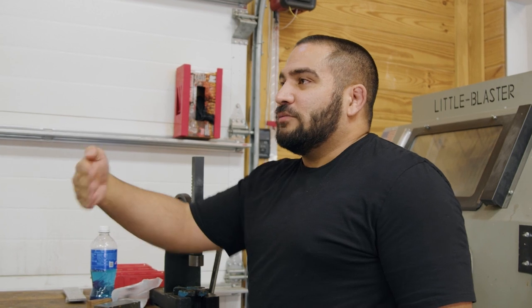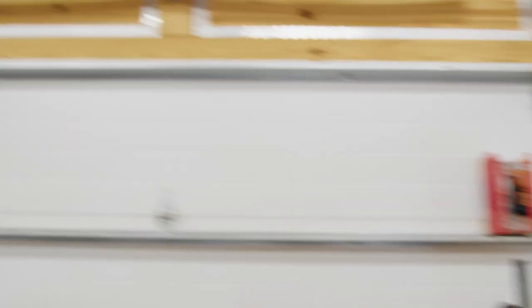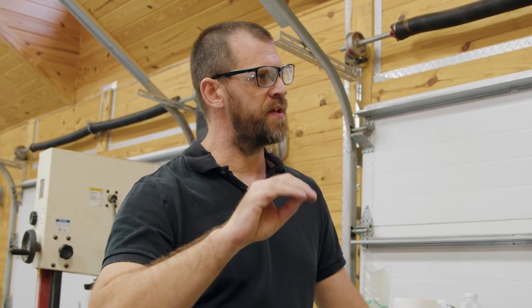Stone manufacturers make you think you need all of those grits. Since Javen isn't selling any stone, he's telling exactly how he does it. For his production knives, he starts at 220-grit belt, polishes with 440, and finishes with a leather strop — that's all the sharpening for production blades. What about systems like the Wicked Edge — do you need the honing fluid? Yes, absolutely. If you don't use honing fluid, the stone fills with slurry and every pass removes stock that has to go somewhere.